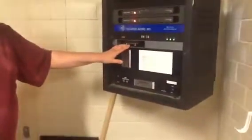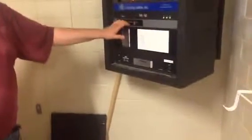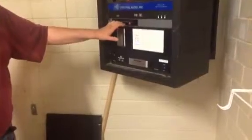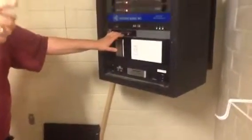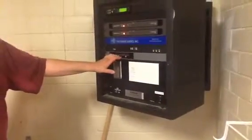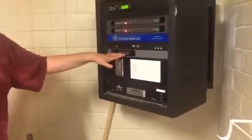The other reason for the splitter, even more importantly than making sure the DMX is being distributed correctly, is that it's optically isolated. Because you've got 8 LED instruments here, 2 dimmer strips up there, and a lighting board over there, they're all plugged into power somewhere. And if you wind up having an electrical fault in there and you don't have it isolated, that electrical fault can come back and destroy everything.